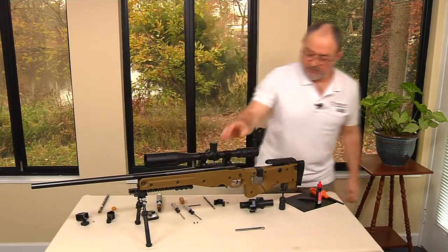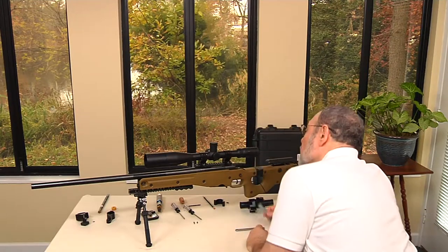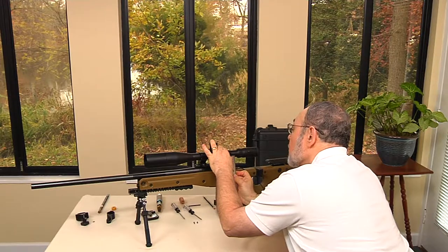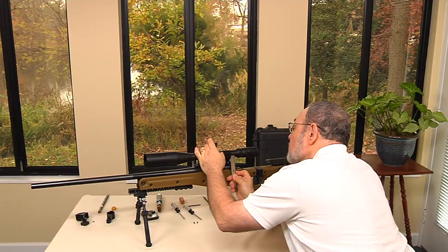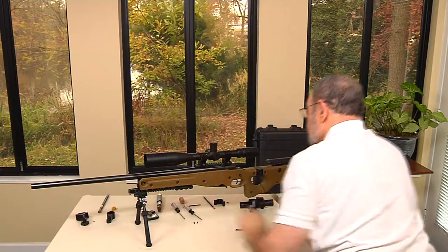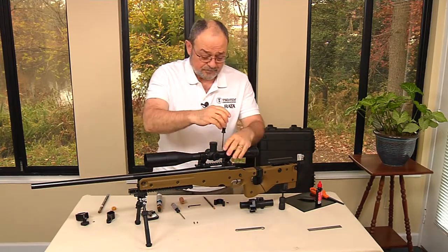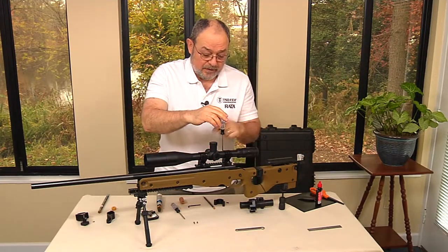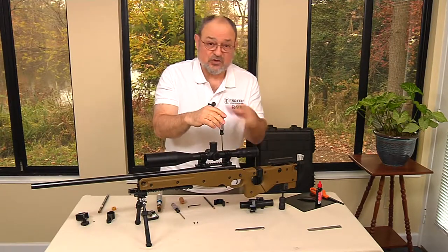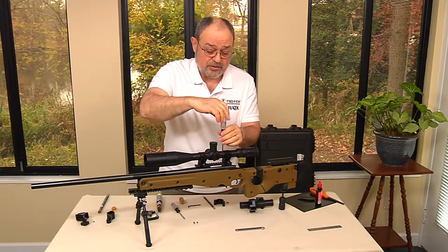Before we tighten them up, we have the distance, but we need to make sure we've kept our reference point. There is that line — I put it against the flat and it's right against my line. Now I can tighten them again, and when I tighten them I go crossways. A lot of people don't go crossways right away — they tighten them the same number first and then go crossways when they torque. But I like to go crossways from the start.